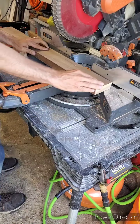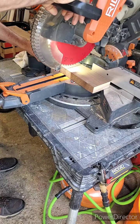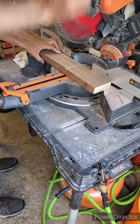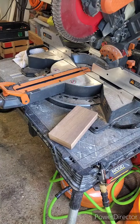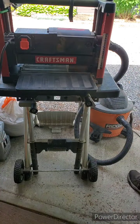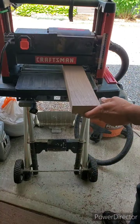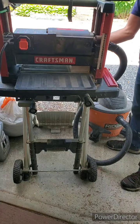Now I'm using the miter box to trim up the length of the legs. You can do this by hand or use the table saw, but it was just easier to use the miter box in this situation. One of my four legs had grain that didn't really match the other three, so I'm milling down a piece of 6-quarter down to an inch and three-eighths to get another leg out of it.